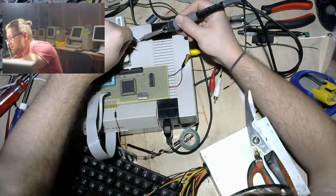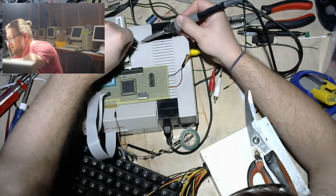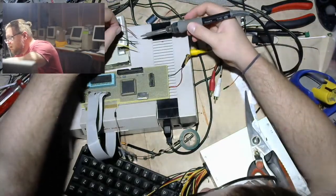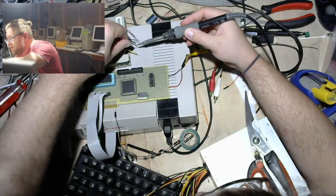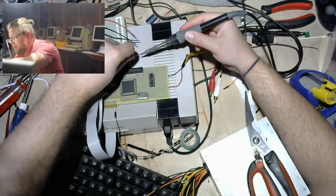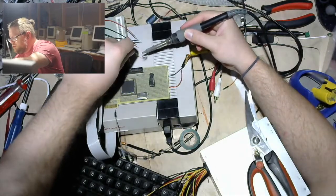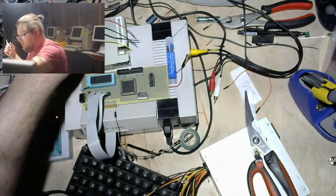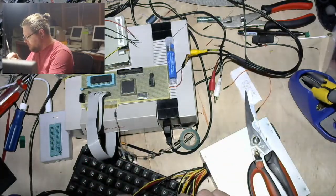If you get to a Commodore 64, there's a bunch more custom chippage in there. There's the VIC for the video, and the PLA that's used for decoding the memory space for all the devices, and that's just more likely to go wrong, and then you also can't replace it. But the original Apple II is all off-the-shelf parts, so A, pretty reliable because they were used and vetted by more groups than just the manufacturer of that machine. And if you had to repair them, you can find replacements fairly easily.